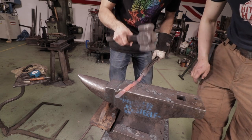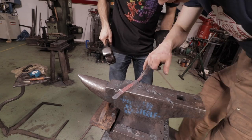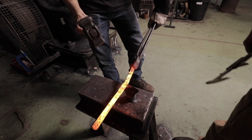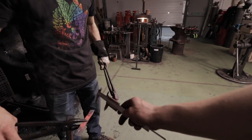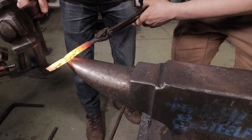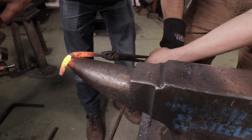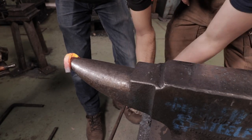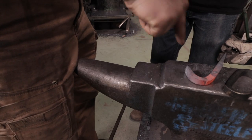Now just flatten it off nice and cleanly. Then another little tweak and straighten. Now we're going to be ready to cut that off, and then we can start bending it. Take a pair of tongs and break it off — one hit cut. Now we're going to flip it around and just clean up this end here, and hammer over the edge. Now with this left hand, drop this left hand as you hammer — you see you're hammering at this angle here. Lighter, lighter, lighter. Keep dropping it. It's more curved now, definitely more curved up towards here. So next heat, we've just been working like this — it's difficult to work all the way under like this. Instead, we can turn it around and work like this.